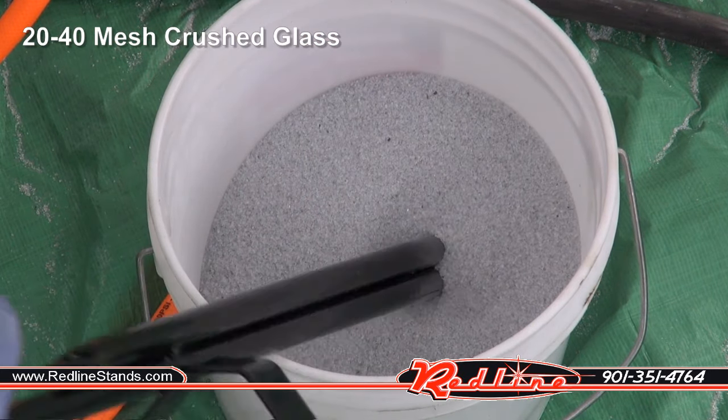I know you guys are going to ask about my air compressor. I'm running 17 CFM at 155 PSI, unregulated for the blasting I did earlier. If you want to have a look at the glass and see what worked best, pause the video right now.